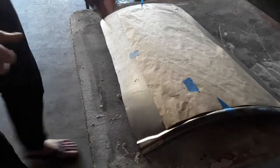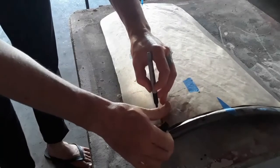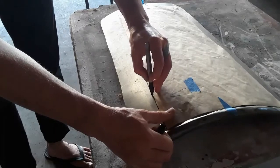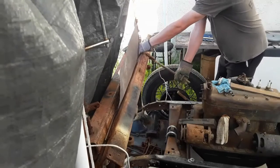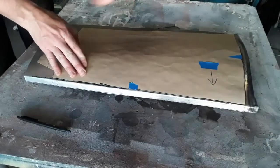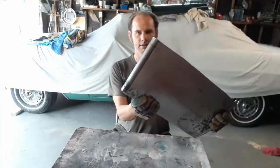There are a few ways to fix this problem. The way I'm doing it is by heat shrinking the part under the bead. This is done by warming up one small section at a time of a high spot and then beating it down with a hammer while it's cooling. Next, I cut out the pattern on the front where the panel meets the firewall to bend that edge over. Every time I cut something out of this pattern, I take it back to the original and compare it to make sure nothing's getting distorted. Now I'm folding the front edge over with this heavy-duty metal brake that I homemade myself, because Harbor Freight doesn't sell one this size. And then we go through the exact same routine for the lower bead - and that's done.